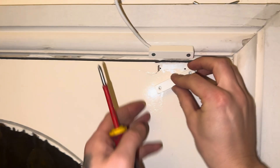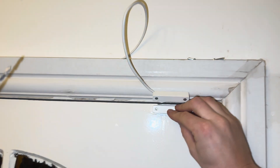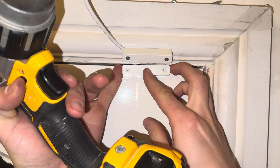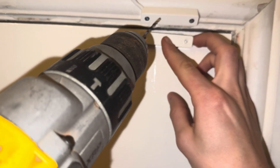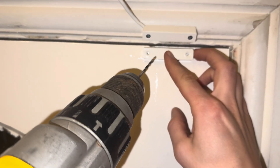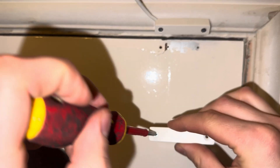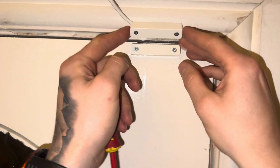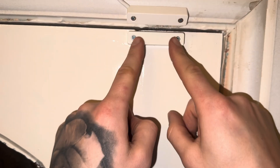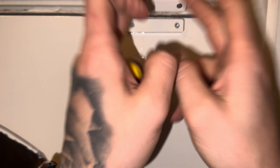Now it's time for the magnet. Always put your magnet on the door with the reed switch off the door. A common mistake is pushing them right up together — you actually have around half an inch to an inch of space that can be between them and it will still close the reed switch no problem. You don't want them touching because doors swell. Drill the pilot hole, screw on the magnet nice and straight, and there we have it — a neat job with the contact on the frame and the magnet on the door. Now we need to go wire this into the alarm control panel.